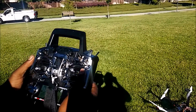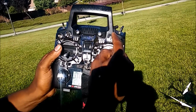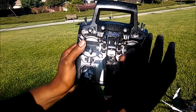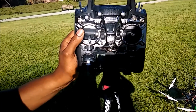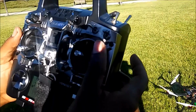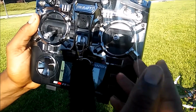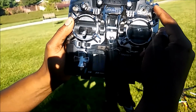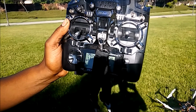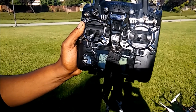All right, we are in. So just going to go through a few flight modes. This toggle switch is a 3-position switch, and this will go through your flight modes. First flight mode is always stabilize, switch in the upright position. Then if I go to mode loiter, that would be loiter. You can actually hear the voice confirmation. If I switch here, mode auto. Auto mode. I go back up, mode stabilize. Now this is your shift key, basically. Click this: mode altitude hold. Mode guided, that's guided mode, which you can have the drone follow you, and mode return to launch, that is your emergency return to launch mode.